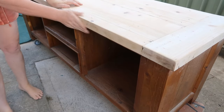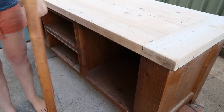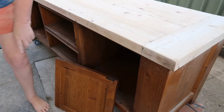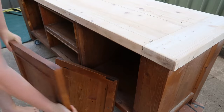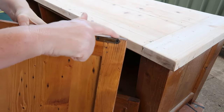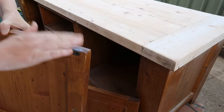That's come up really nicely — it wasn't too bad. So that's the rough sanding done. Now, I mentioned when I was inspecting these that I wanted to take the top of those door edges down a little bit. If you look at it, one sits a little bit higher on that ridge, and that's what would end up catching if I just painted straight over, so I just want to bring that down a bit to make it level.